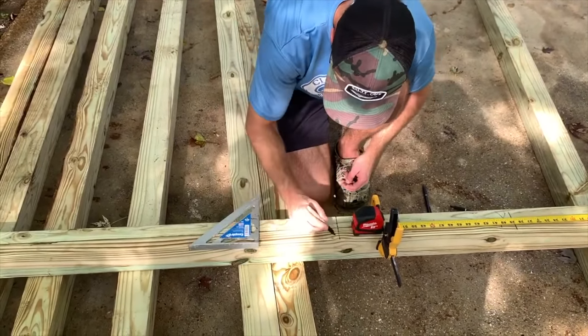We're gonna rotate it until we get to the 2 marking on the common rafter scale, as I'll show when I zoom in right here. See, it says pivot right there on that pivot point. And then we're gonna go until you see the 2, which is right there. And that's where it says common. So as you can see, that's our common rafter right there. We have that on the 2.